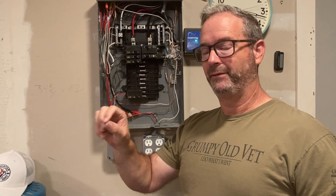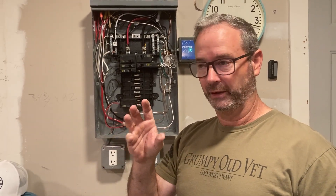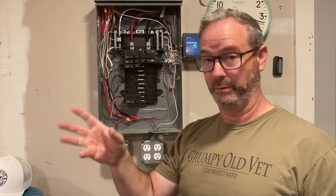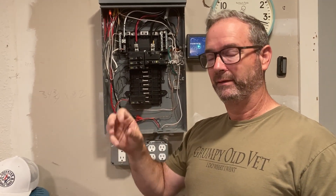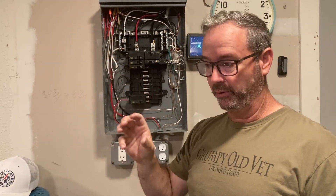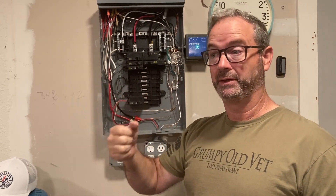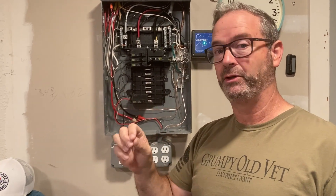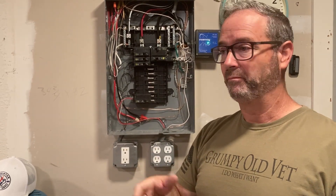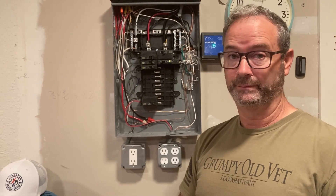Last thing for the homeowners — why busing burns. Here's the thing: you don't have to replace your panel instantly. If you watch my videos, you know I intensely dislike electricians who use fear to cause homeowners to make big purchases. If you have one spot that's burning and they open it and check it, you can take a new breaker, plug it in on fresh bus, extend your wires, and that'll get you by short-term. Unless there's prolific burning and something's come loose, you don't have to replace the panel right then. Ultimately you should change that panel, but don't let some shyster say you need to spend umpteen thousand dollars or you're going to die in your sleep. That's not usually true.